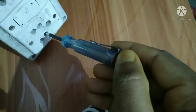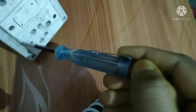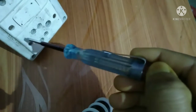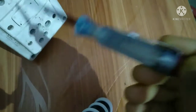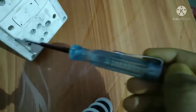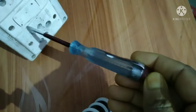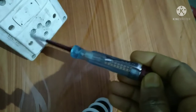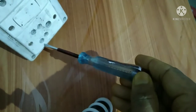If the board is okay and the house wiring is okay — there is no fault, no cut, no short circuit — then one side will not glow and the other side will glow in the phase tester. That is normal correct behavior.